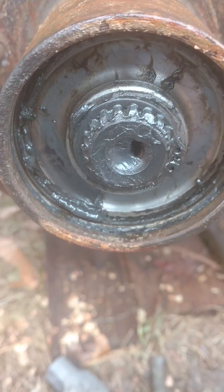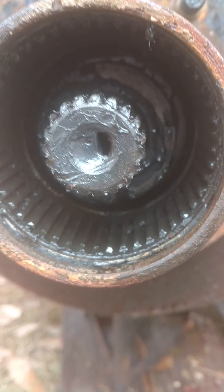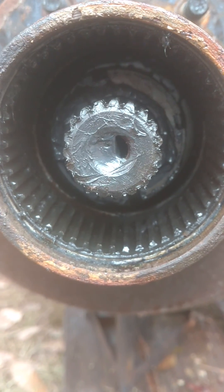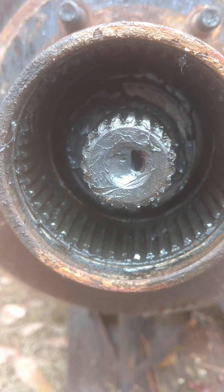Next we have a snap ring to get out — use snap ring pliers and a screwdriver. If everything goes according to plan, as soon as you take that snap ring off, this hub will shoot out because it's spring-loaded. Next we have a notched locking nut in there with four places where a socket will fit.